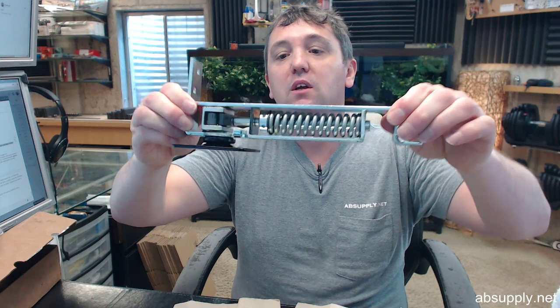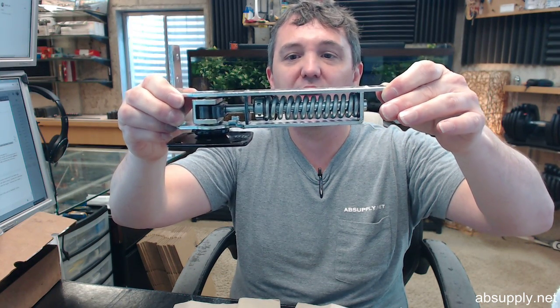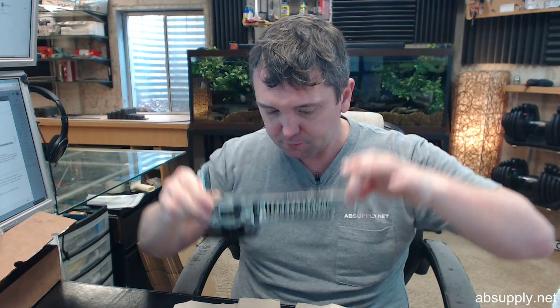A few drops. I like to put some paper towels underneath the door before I'm doing that, and I like to leave them there. I like to pat the face of it so that I'm not having dripping oil on the floor. And that will bring it back to a reliable, quiet or quieter installation. You might also put a little bit on the spring, but there's really nothing there you're going to need to lubricate. It's those moving parts that you're going to find.